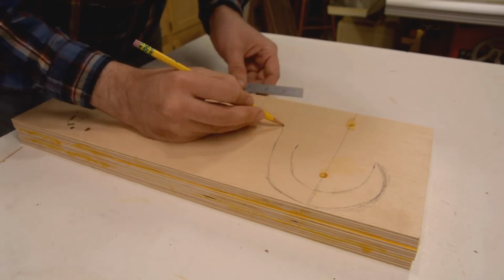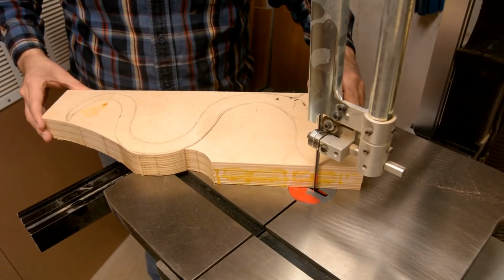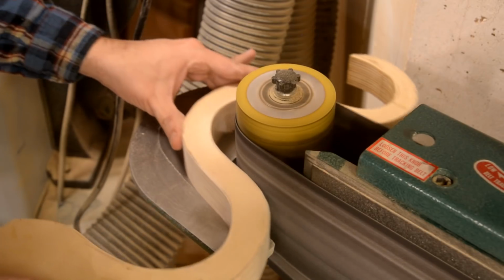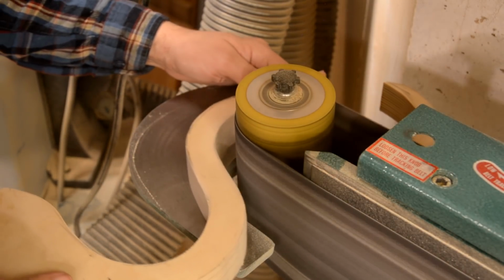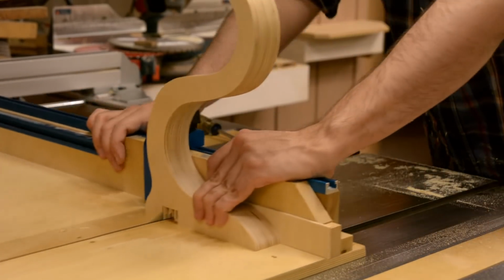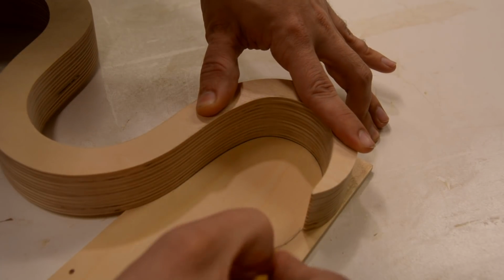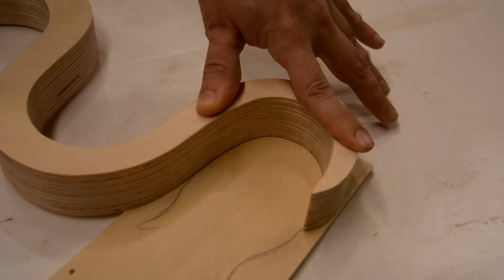So as I'm drawing up the frame, I know my pieces of walnut are a given size, and I can't make them any bigger than that. So I'm drawing those loops that are going to hold the boxes with that size in mind. And the idea was that the top one would be the smallest and the bottom one would be the biggest. To keep it from tipping over, there's another piece going across it, and that is held in place just by a lap joint.